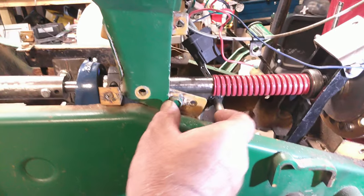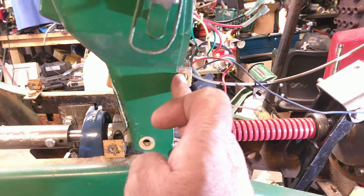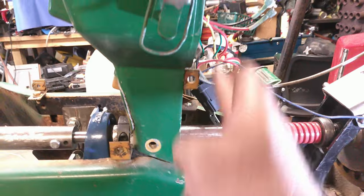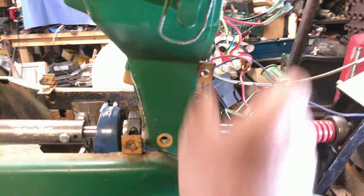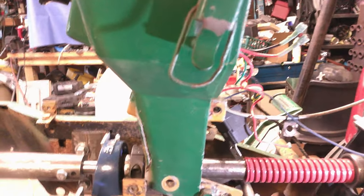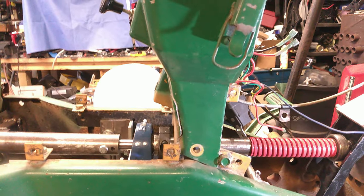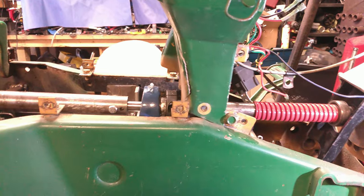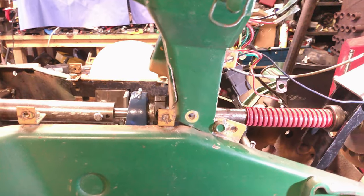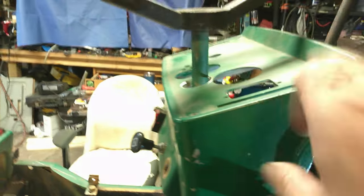What we're going to do is just make up a like a two-inch plate — we can bolt it in here, put a bolt in here — and because it kind of drops down like this, we'll make it a little wider, then just weld that to that. That'll be our filler piece and our stabilizer for our column. I'm gonna finish taking this thing back off and bring you guys back whenever we get that thing welded up. We gotta move the bearing and bushing up here that mounts, and get the aluminum plate made.